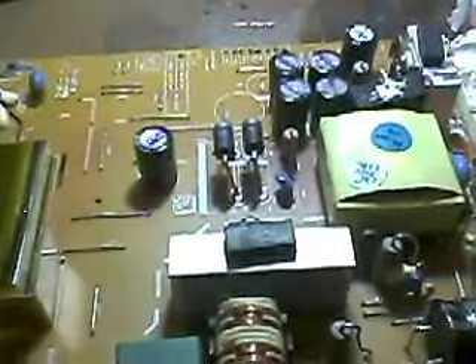It actually kept the temperature down on the capacitors, so I thought: why not do the same here? It's a tiny 5-volt little fan and I'm sticking it right in between the heat sink — on the back of the heat sink because there's no room on the other side. I put a little bit of cement on it. It's only about 90 milliamps, so it won't stress the circuit at all. It's going to suck and blow cool air onto the capacitors to keep them cool.